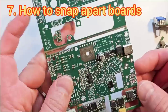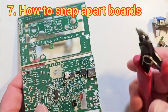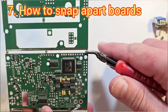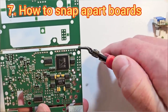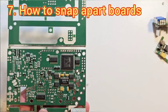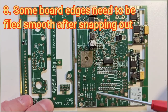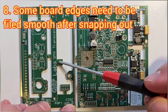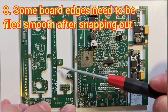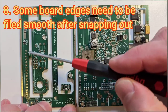The next thing to do is to break the boards into pieces. I like to use a pair of rather blunt wire cutters for that, keeping the sharp ones for later. My favourite way is for each tab you have to snap — just grab it and twist it until it breaks off, so you're not putting any pressure on any of the components. When you break apart the board into its various pieces, remember to also break off the tabs and don't lose those because you need them as spacers later to space the control board, but you need to file off their rough edges.